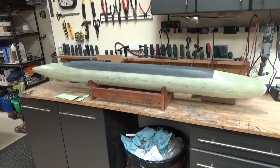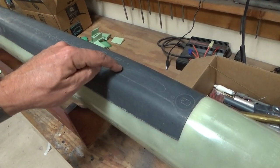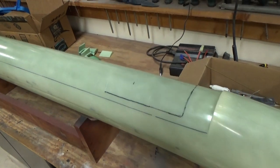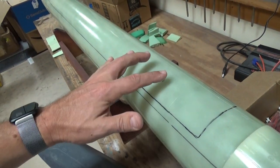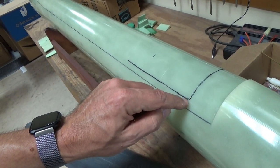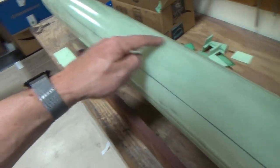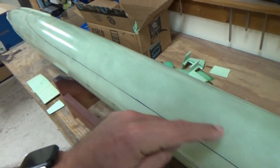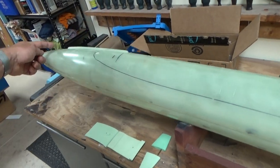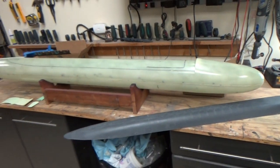This is feeling good — nice, neat, and tidy. Without sacrificing cosmetics or functionality, this will fit neatly into a transport case for easy travel to and from the pond, as well as easy storage. You can see this beautifully scribed outline of the sail that's going to get cut out. On the upper deck there are scribed lines for openings that allow flooding and venting of the upper hull — I'm going to extend that line forward about two and a half inches to allow access to the sail linkages, retaining surrounding sections for strength and rigidity.